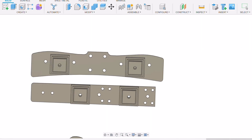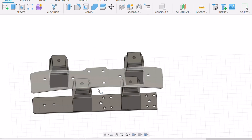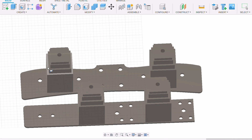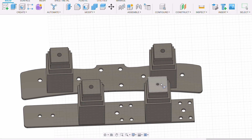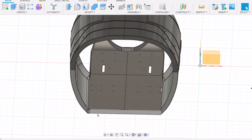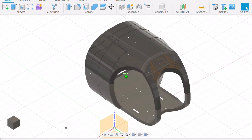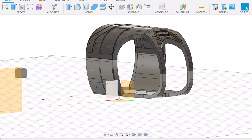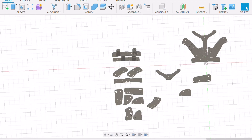The center spine piece will be 3D printed in two halves so I can test exactly where it needs to sit on the back armor plate — I know it'll be between about 50 and 70mm off the back plate but I'm not 100% which, and because there is that hinged movement in the spine pieces that extra 10 or 20mm does matter. If the gap is too small it might clash with the back plate; too big and the chest and back plate might be too tight on the user. The other parts will be cut out of fiberglass sheet to cut costs, although the fiberglass was nearly the price of carbon fiber.